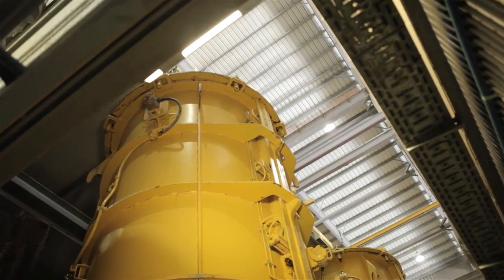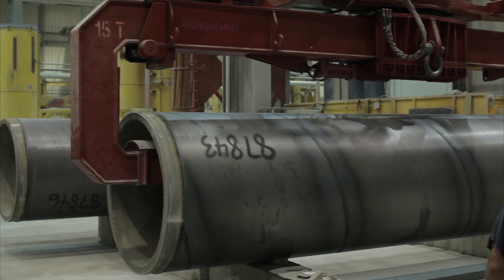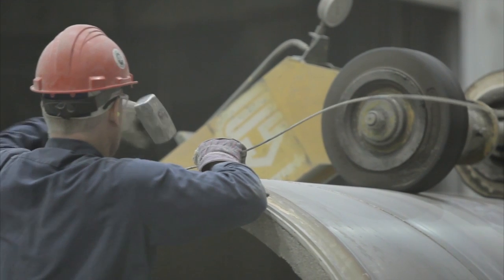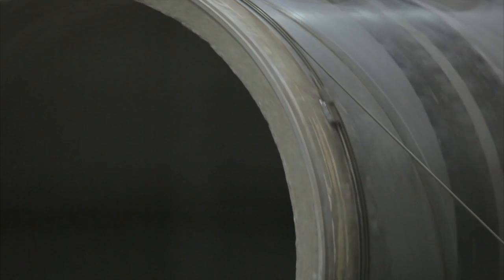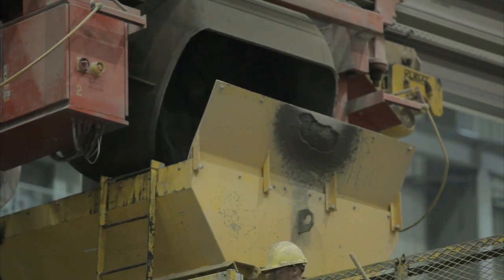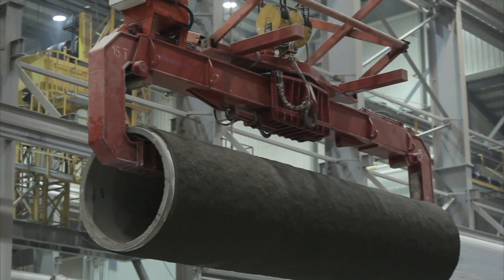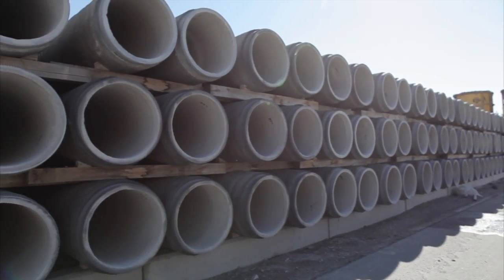The pipe is placed in a cure cell for elevated temperature curing with steam. Once the concrete reaches sufficient strength, pre-stressing wire is attached to the exterior of the pipe at one end and wrapped under controlled tension and spacing from one end to the other as a cement slurry is applied. The pipe, now wrapped with the pre-stressing wire, is mounted on a revolver and rotated while a machine coats the exterior with a second application of cement slurry and the finished surface of mortar coating. Once the mortar cures, the pipe is ready to be shipped and placed into service.